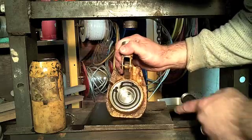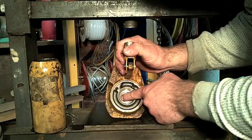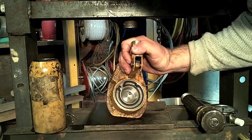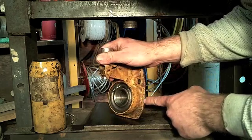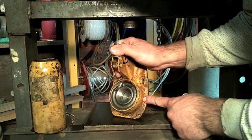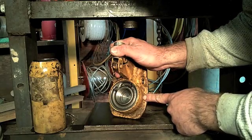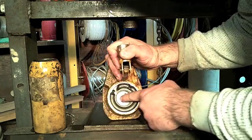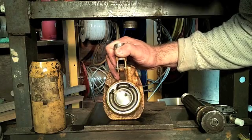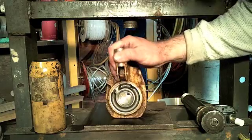So now we're ready for the milling process. What's got to be done is we've got to tap into the center of this part here. But if you touch with your drill bit that edge or any of these threads, the jack is ruined. There's not a whole lot of wiggle room in there, but we're going to have to find a way to go in through the side here, breach it in the center, and then drill and tap this out for your gauge. Take some careful measurements, do some careful planning, and make sure you get this right. The other opportunity is to go straight to the bottom, which isn't an option in this press.